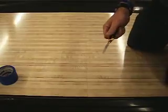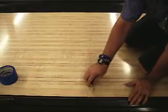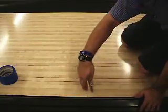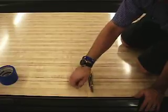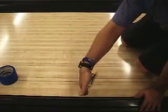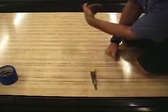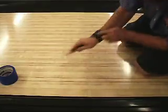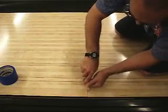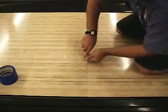I'm going to take our razor blade — a really thin blade, you want to use as thin as you can — and I'm going to be cutting down the seam. The blade itself has an angle on it, so as I cut I'm going to be tipping the angle to one side. I'll tip it first to the upper, raised portion of the lane and cut along that side, then run it back down and cut on the lowered portion toward myself. So I'm cutting it off both sides. Don't get in a hurry — last thing you want to do is gouge up your lane.